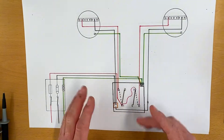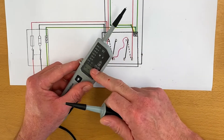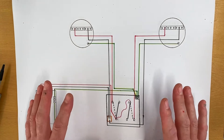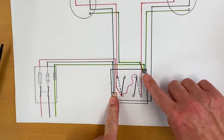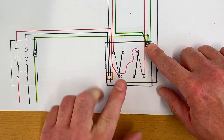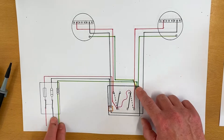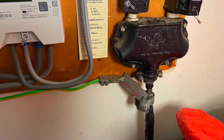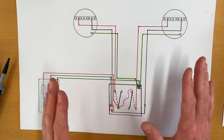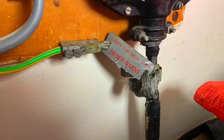When we were doing our testing for voltage we kept getting that continuity beep. Whenever I touched between my neutral and protective conductors I got a beep - no voltage, but a continuity beep. Hopefully we can realize why. When we test between our neutral and our CPC at the switch, we got a continuity beep. When we think about where this cable goes through to the consumer unit, the installation we were at had a TNS earthing arrangement - terra neutral separate. You might think the neutral and CPC can't be connected together as they're separate.